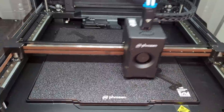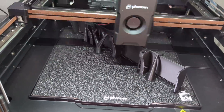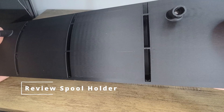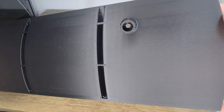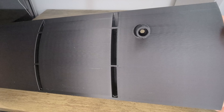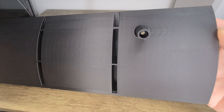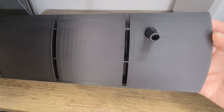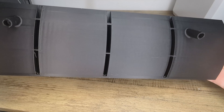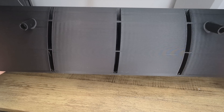Overall, really good performance up to that point. So let's skip forward and take a look at the final results. Where do I even start? Well, the part doesn't look great. There are all kinds of artifacts on the print. I already spotted some acceleration artifacts all over the screw holes, and there are belt artifacts scattered all over the surface. So yeah, that's not good for a printer in this class.